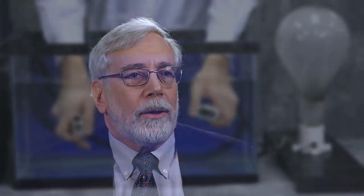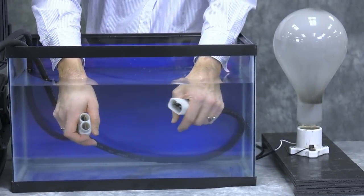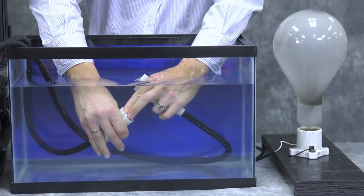When niobium is in contact with water, it will react very quickly to form a film — a passive film — which completely covers the contact. That film then acts as an insulator. Although it's only a couple of molecules thick, the film prevents any current from leaving that contact and going into the water.